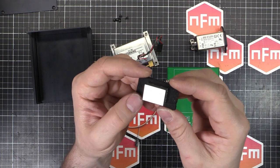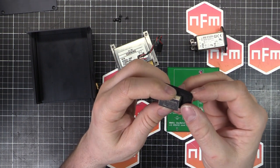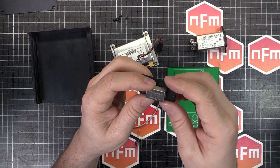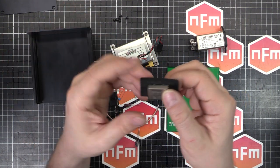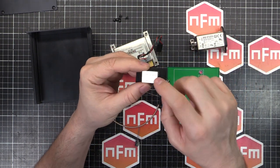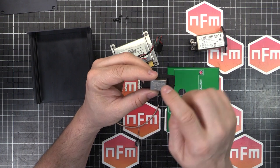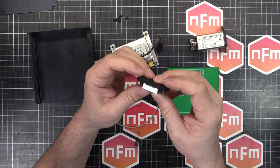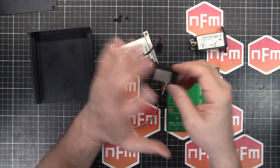It's very good quality. TDK makes some really good power supplies and filters. Their Lambda line is all power supplies and filters, and TDK make other things beyond that - the TDK Lambda is a very nice range. It's designed to put out 12V, but if you short two of the pins together you can make it go into a 15V mode. So it's 5V in, 15V out. That's going to work perfectly, because this can supply stable voltage down to 0mA of load. Some buck and boost converters won't work well with no load - they have a minimum load rating. This one's minimum load is 0, so it's going to work no matter what.